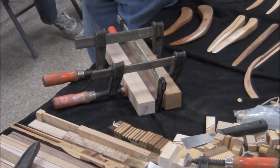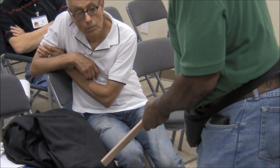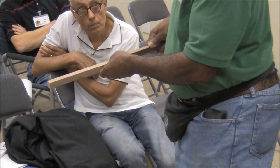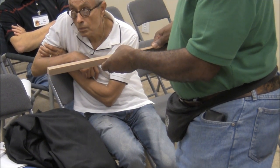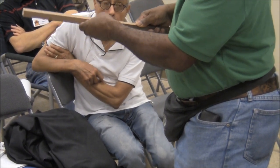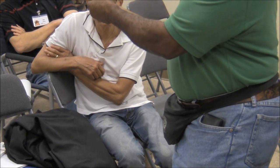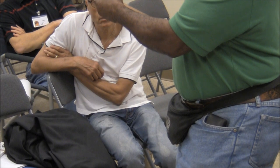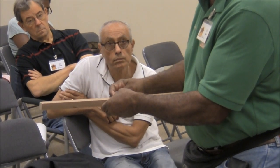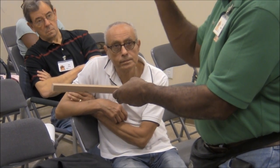I don't care how you try to do it, your piece is not perfectly straight. Sometimes you might have just a slight crook. But if the crook is too much, that means your glue joint is probably not going to hold. But a little bit of a crook is fine. You have to do it enough to judge whether or not it's going to be all right. Because what you've done is mashed the fibers in a little bit more on one side than the other. But if it's too much, the glue has gotten hard, but glue won't fill up gaps. That's why you want thin glue lines.